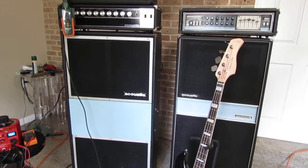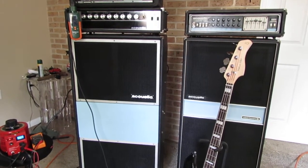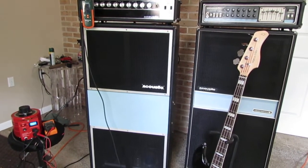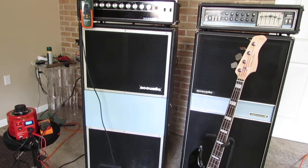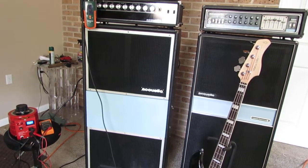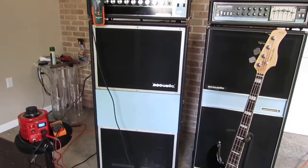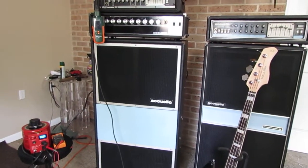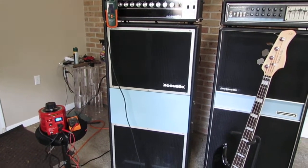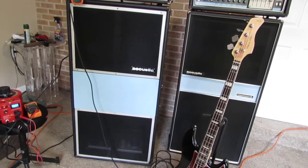It's an issue that's hard for some people to wrap their mind around, and that's what we're dealing with: low voltage. That's what happened at that show. It performed well during sound check, but when everything got powered up for the show, it started dropping the voltage on that circuit and just caused this amp to fall out. Some people ask why their amp didn't go out — well, yours didn't need the power that this one required. That's why yours didn't fall out. This is an older amp too, so that probably makes some difference.